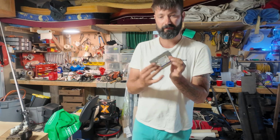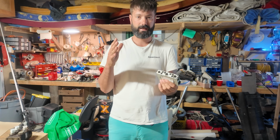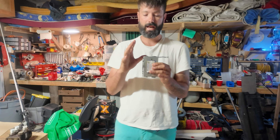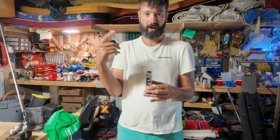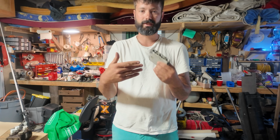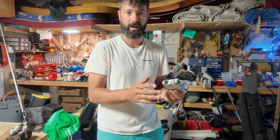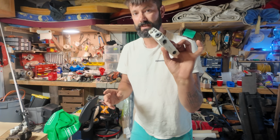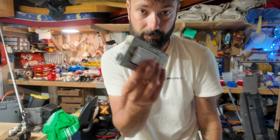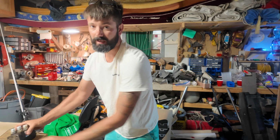Now this is a Model 50 Uniflow valve. The job this did was to add protection for the forward helm, the main helm, and not let the autopilot spin the helm and not let feedback from the rudder spin the helm. So it's basically just a series of gates, and that's why the helm needed 3 lines. This has been made redundant though, because most helms these days don't use a separate piece to do that. They include it as part of the design of the actual helm.